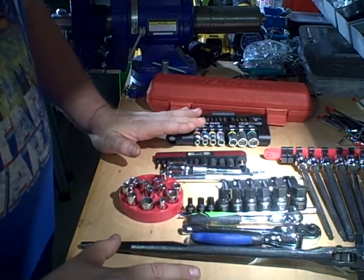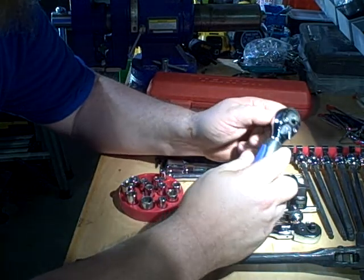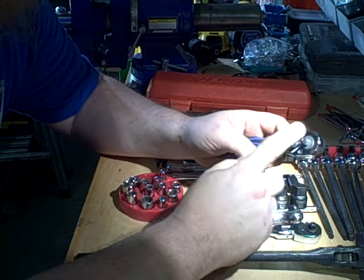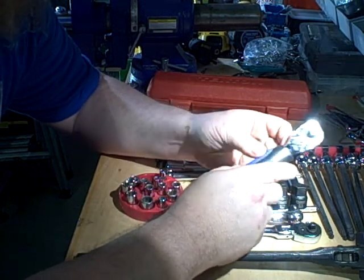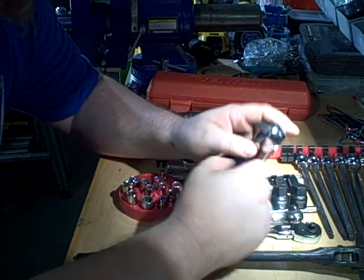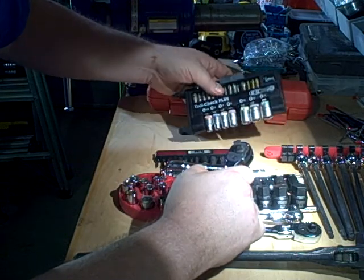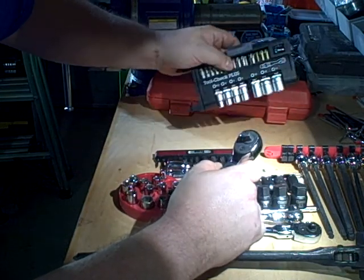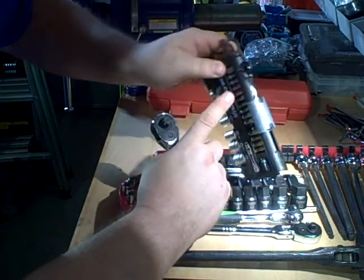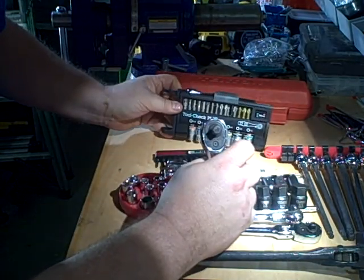So when we're talking about a ratchet or a drive, we're talking about a tool like this. Now this one's a combination, and I like to carry combination type tools. This is 3/8 and a quarter. Something like this I'll throw in my bag, and I'll throw a small socket set, something along this size. Now this is Wera, and it has its own little ratchet type drive right there. It'll take a piece, put it in, then you can drive the ratchet, and then it'll drive all the screws too. I mean, use all the bits.